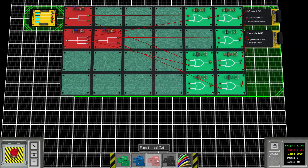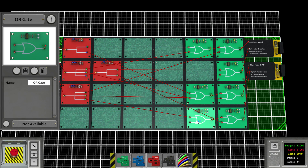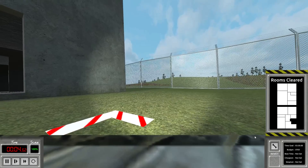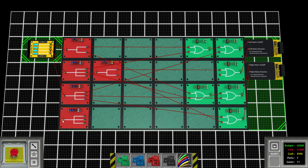Now for the D key — we want to steer to the right, so that means left motors go straight and right motors go backwards. We're gonna need a triple signal splitter for that. D goes here — we want to turn on the left motor, we also want to turn on the right motor, and the right motor should go in reverse direction. Let me see, maybe we could get rid of this one and hook this straight up. Testing it: D — okay, it allows me to turn around, go straight and back. That's fine.